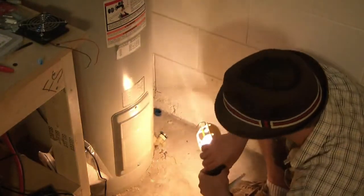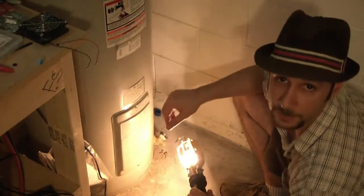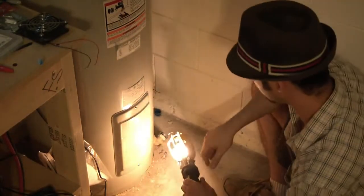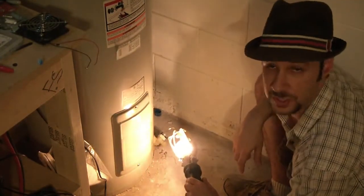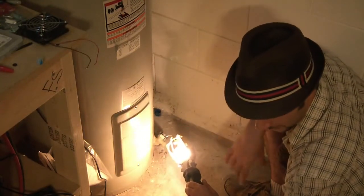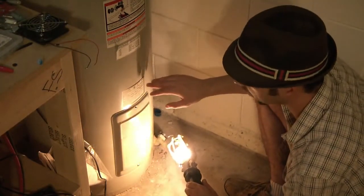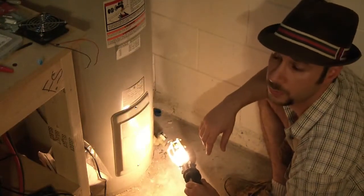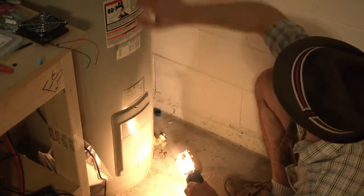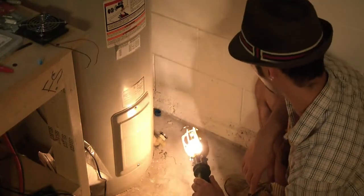Just make sure all the crap is out of there and nothing collects on the elements. This particular unit is electric — it wouldn't make much sense if it was gas because of the pilot light. But this actually has an element in the top and bottom, so I have two controls — two little inspection panels that actually control the temperature top and bottom. What you're going to want to do is get yourself maybe a turkey thermometer or meat thermometer, whatever you have in the house. Make sure your hot water after running for a couple minutes is about 120 degrees. If it's any more than that, it's really overkill and you're just wasting electricity. You can adjust the temperature by going to both of these little thermostats, and adjust until you see 120 degrees out of your hot water — that will be perfect.